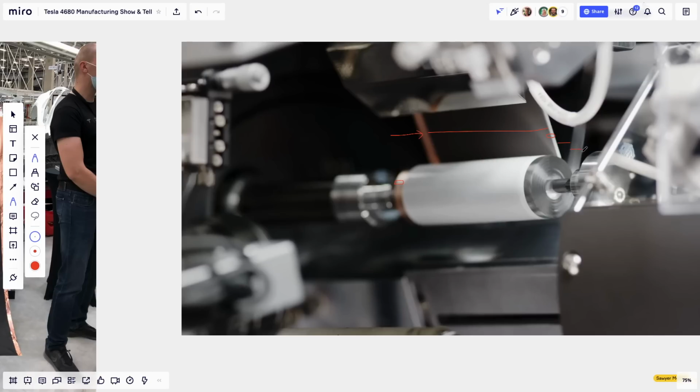Here, the same strip where the flags are going to be, where the flags are cut, and it's being rolled. And you can see the aluminum here being rolled. And behind that, you have to imagine what's behind this foil, you can't actually see it, because it's basically the same as this side. On the opposite side of the copper here, you will have a little bit of overlap of white separator material. And if you look behind this aluminum, which is the cathode, if you wound,